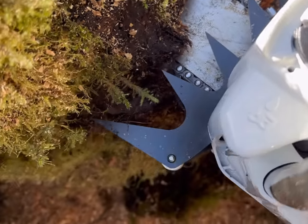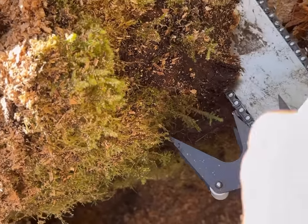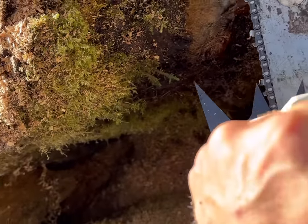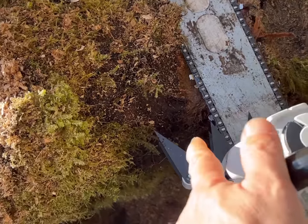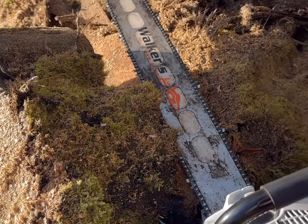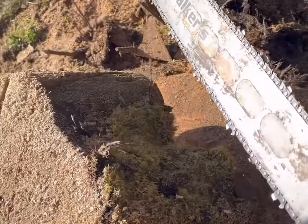With the five points, you can still see the chain pretty good and you're dogged in back there, but when you go to make your face you're kind of guessing where to put that back dog. If you were to plant your dog in and then make your undercut, you are guessing where to put it unless you eyeball your bar in and bring the dog around. All these dogs work really well — it's just some of the nice features of having one versus the other.